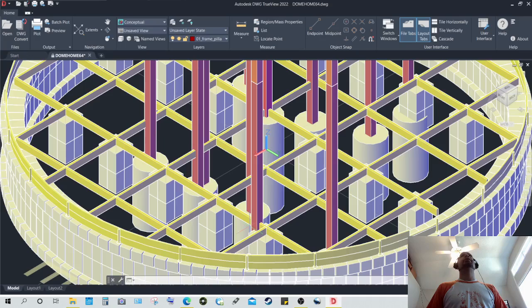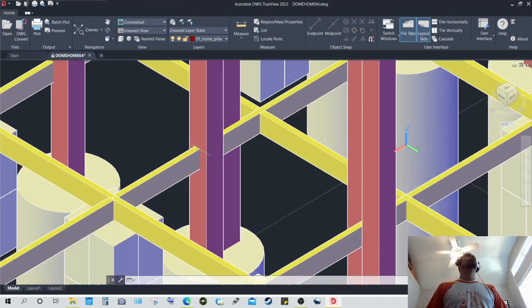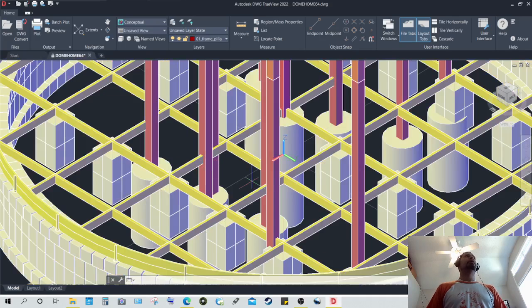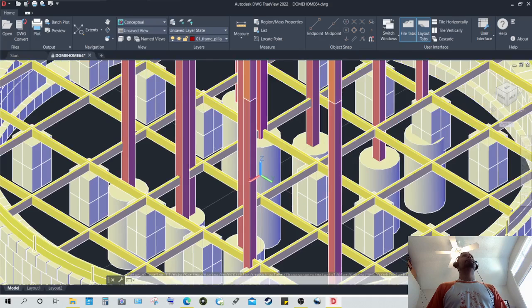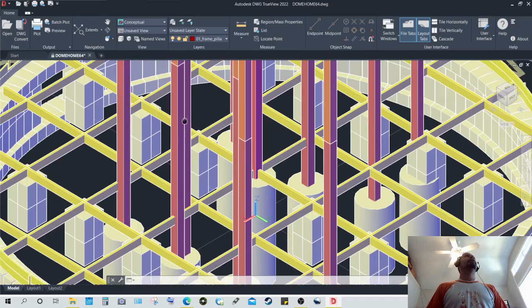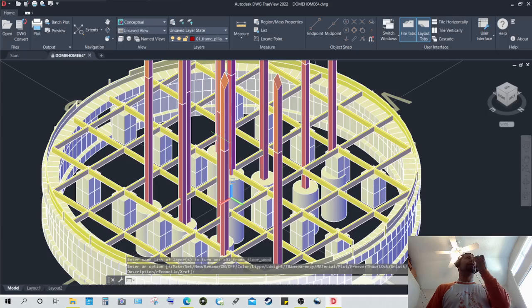So right here, attachment right there. Of course, that looks like it's going right through it, but you don't want to make that hole on that pillar or column. You want to break this member and brace it, attach it to the complete pillar or column. Attachment points right here and here, center, of course, and wherever they meet there would be attachments, secured attachment points via bolts.